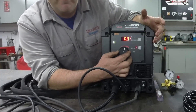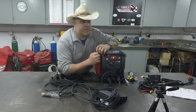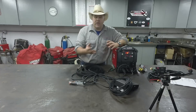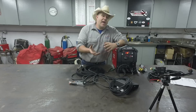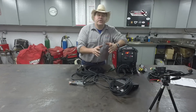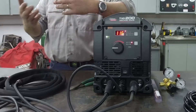The next setting is the pulser. With the pulser on, you can set how often it pulses — it manually pulses the output current like a metronome, which is really helpful for beginners or when welding very thin material. Next is AC balance. In an ideal world we'd perfectly control penetration, cleaning action, and all other aspects of the AC sine wave. We can't do that perfectly, but we can shift where the AC waveform spends more of its time — more positive or more negative. Spending more time in the negative puts more heat into the base metal, making the machine more efficient and allowing you to weld thicker material with less current.